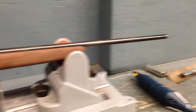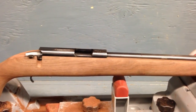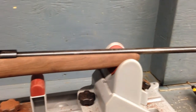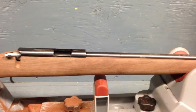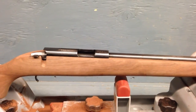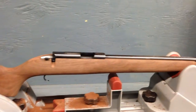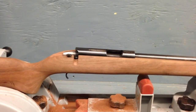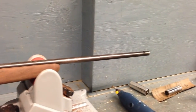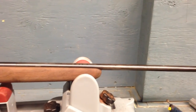I've done a lot of grinding with the Dremel and sanding. The barrel channel is complete and the action fits. There's a little bit of a hump somewhere — I've been relieving the inside of the stock, a pressure point at the end about an inch. I'm also going to relieve some material just in front of the receiver and bed that a little bit. Unfortunately this particular gun only has one stock screw, so it's really tricky to glass bed the back of the receiver where the tang is. But it's starting to look pretty good — that barrel sits nice in that barrel channel.